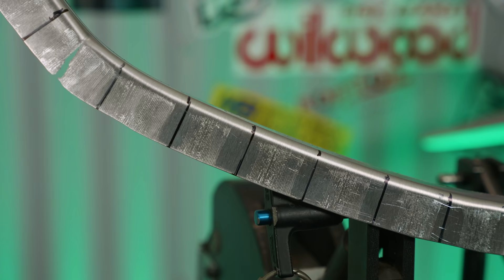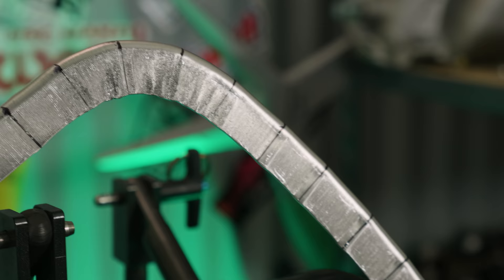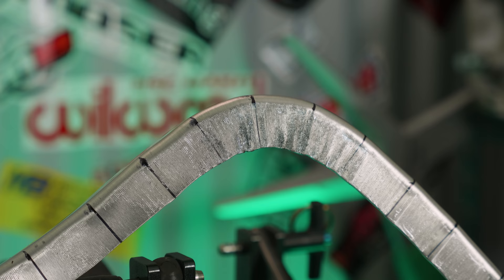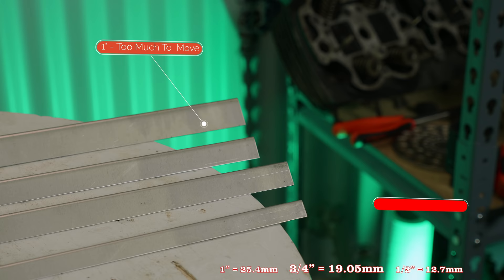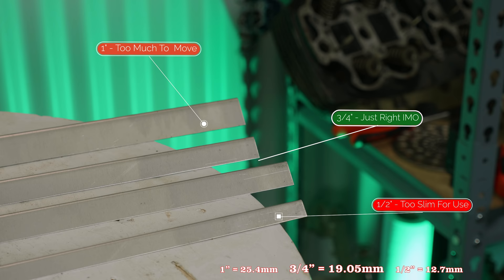These can be used for a range of different things. The most common places people usually think about are wheel tubs and wheel arches when doing a quarter panel rust repair. You can use these to create that nice arch and follow the shape of an existing piece or create your own shape. One last tip about flanges: I find that three-quarter inch wide flanges is the sweet spot when using a Lancaster style shrinker stretcher. It's enough material for the tool to grab onto effectively, and also wide enough to allow you to hammer and dolly when butt welding against that flange later.